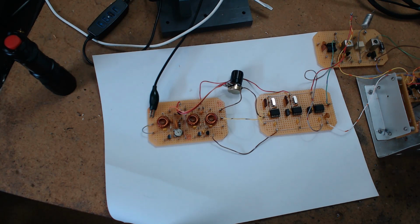Now, the SDR radios basically have no front end. They do have an RF amp that you can switch in and out. So if you switch to a whip antenna, they have an RF amp that kicks in. But there's only like one coil per band. I mean, one little tiny ferrite coil. It's not even a coil, it's a choke.